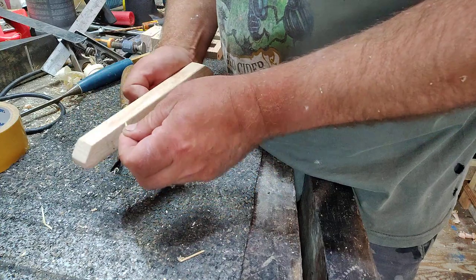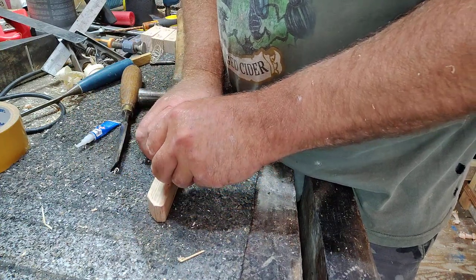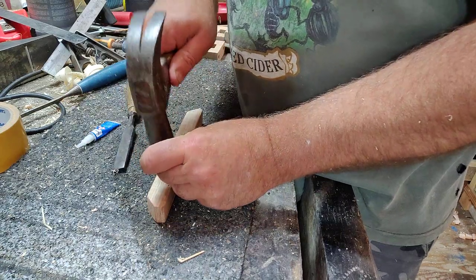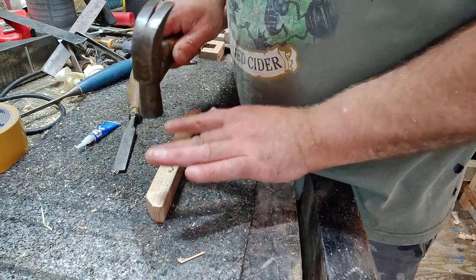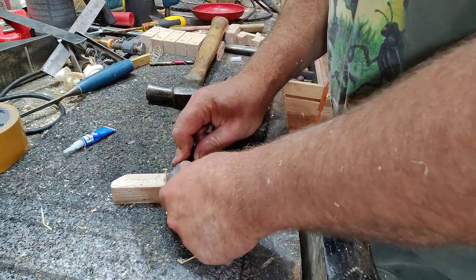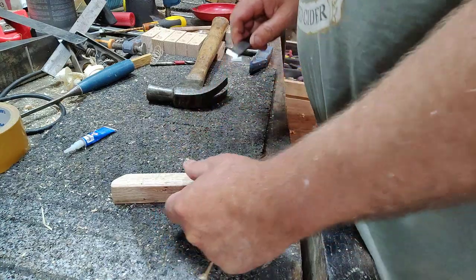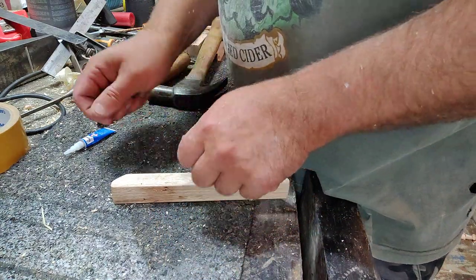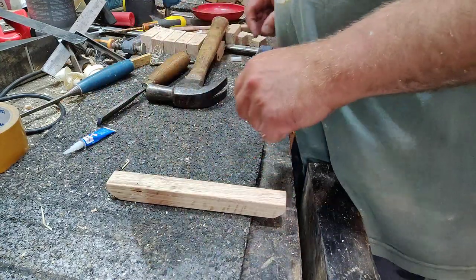One over there. Make a bit of glue off there because I put too much on the side. And then we'll just take it over the sander and just sand it off. And these holes will be, you know, okay. If you're worried about the colour, you can always dye the wood. Or you could use a matching piece of timber and trim a piece down into like a cocktail stick. It could be square even, it doesn't really matter, but it does the job.